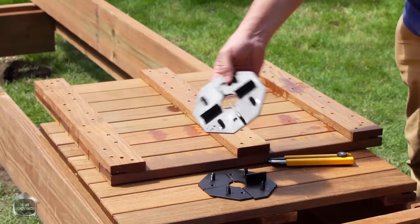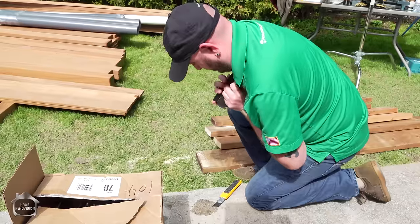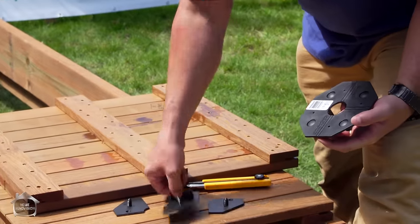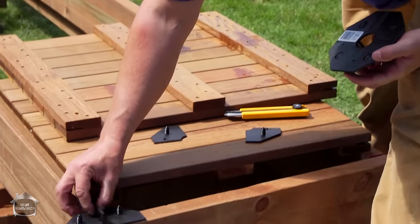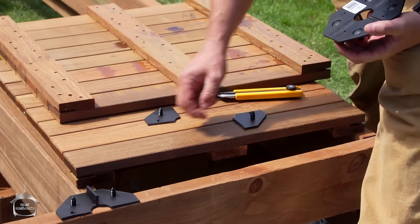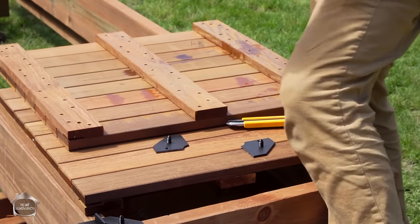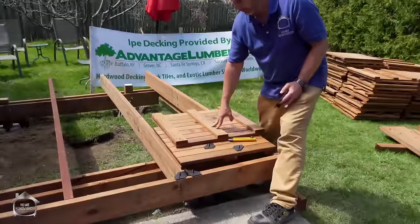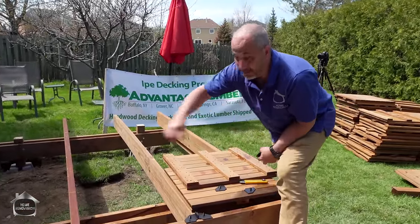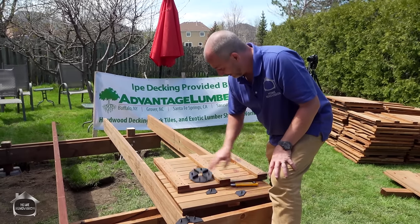Now the really cool thing about this is it's designed with weak spots built into the backside. So you can actually cut it into outside corners or the joints along the front edge. And you just take these pieces, install them, screw them in place if you need to. But once you get started, you can actually move the carriage of this deck to line up with these panels and keep everything perfectly square. Throw in a few screws into the box beam as you go. Presto, change-o, we're gonna have a deck in about an hour.